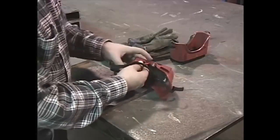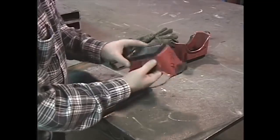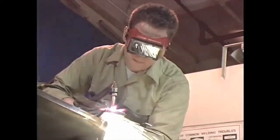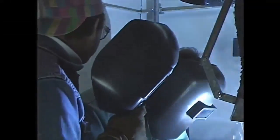Goggles fitted with specially tinted lenses must be worn during oxy-fuel cutting, welding, and brazing. These special lenses block hazardous light and help shield your eyes from molten spatter. Arc welding produces an intense light that requires even stronger protection. Here you'll need a helmet or hand shield. These are fitted with specially designed filters which screen out harmful light rays.